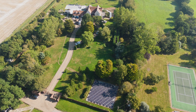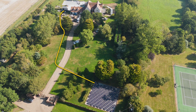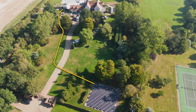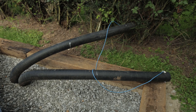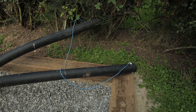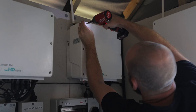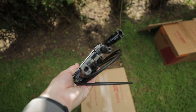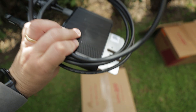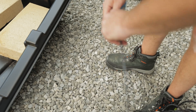Power isn't wireless, so the guys are now pulling the power and comms from the garage where the incoming supply is, to the outbuilding where the equipment is going to be located. One of these ducts goes to the garage for power and comms; the other two go up the garden to the solar array. We've got six strings on this job, two per inverter. With SolarEdge, the maximum amount of optimisers per string is 25. We have 26 to 28 panels per inverter, which is where we get the number of strings from. Before we pull the cable through, I'm marking the ends so we know which cable is which on the other side.